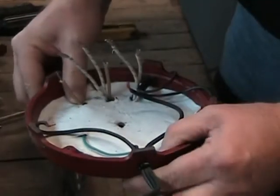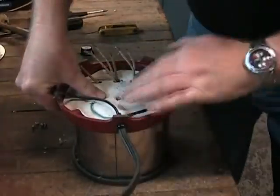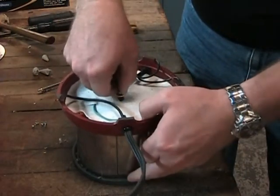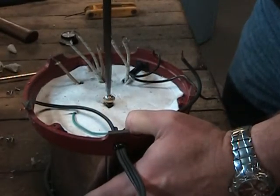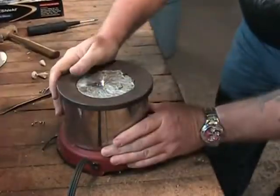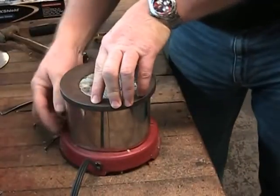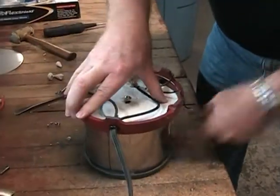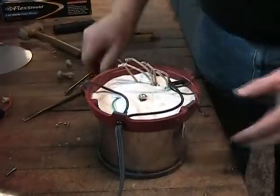Verify that the lead wires have been fully drawn into the base holes and make sure the base is properly seated onto the casing ring. The main assembly bolt including the spacer washers and tensioning spring can now be put back into place — begin tightening by hand to eliminate the possibility of cross-threading, then use a screwdriver to tighten only until you have light tension on the spring. Turn the pot over and make certain that the casing ring assembly is properly seated on the base, resting on the notched portion of the five bosses equally located around the base. When everything is properly aligned, carefully turn the solder pot over again and finish re-tightening the main assembly bolt.